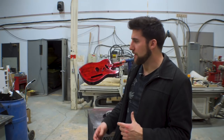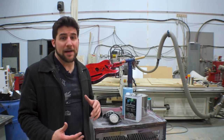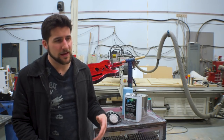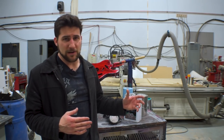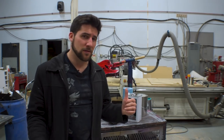You're going to see me use a fairly wide fan pattern. I'm going to spray a light to wet coat, not medium like usual — pretty gentle, at least for the first few coats. It's all lacquer so far — three coats on there already to get the depth of color I wanted, and now I'm going to build up eight more coats over the next few days. The key element: don't rush it. Do one or two coats in a day, probably nothing more than that. If you build it up too fast, when it dries it's going to shrink and you'll get big cracks in your finish. Some people take 10 to 14 days for the spray work, build up their 10 coats or so, then wait a month before polishing. Lacquer is not a fast finish — if you're looking for speed, you're going to want to go catalyzed.